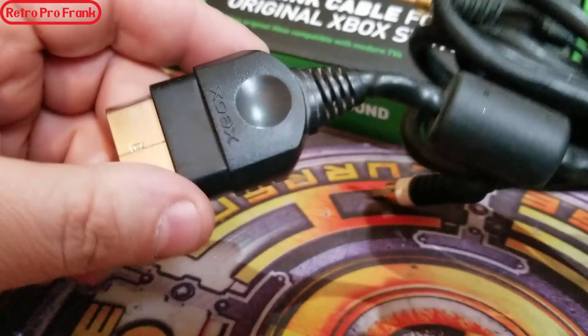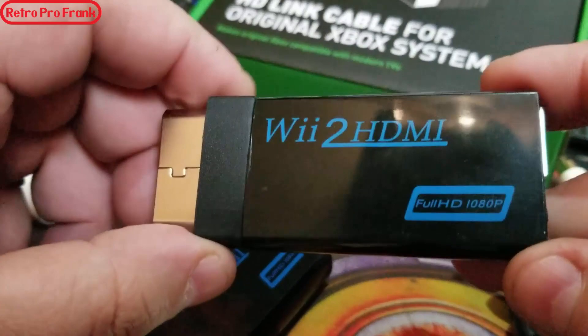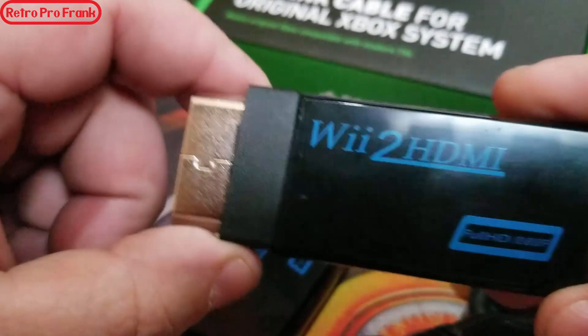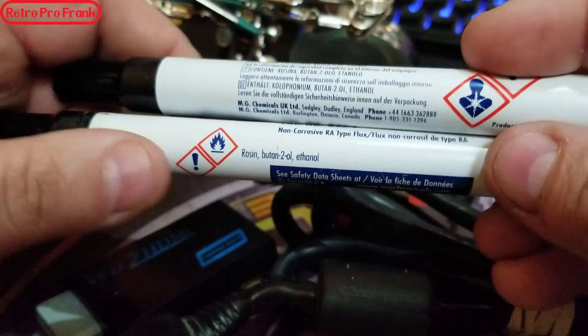You're going to need some wire. Keep the wire as short as possible from the board connections to the D-port — the shorter, the better for reducing interference. On this one I'm running no shielding, just a couple of ground lines. There are actually five ground lines coming off the D-port. The quality is impressive — if it's not the same as the Pound cable, it's pretty close. You'll also need some flux — pen flux works well — plus wire cutters and snippers.